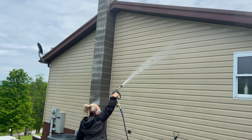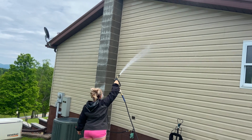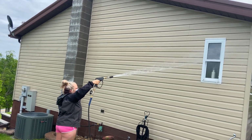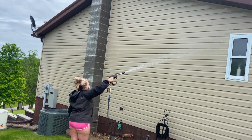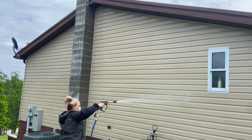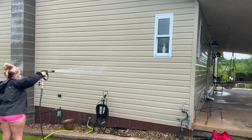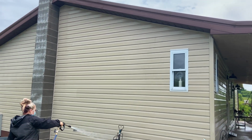All right, now we're on the rinse mode, and generally you can soap a house if you have a good enough machine. Soaping is the easy part. Rinsing is what takes normally the longest. At least it should take the longest, because you really want to make sure you get all the SH off the home and rinse windows very, very well, or you will be getting a callback for spotted windows. Also, if the house has plants, make sure you post-treat the plants with just water.